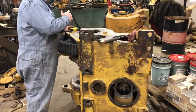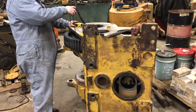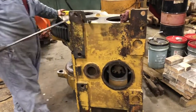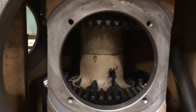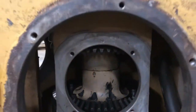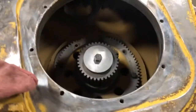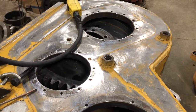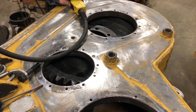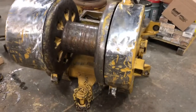We find that most of these winches are easier to assemble when they're on their side — so you can get away with things like the clutch shaft, or in this case the brake shaft — it's easier to drop in from this side. The drum gear is going in. Nothing's easy with these Cat winches, they like to fight you, but we're making progress. Drum gear has been installed.